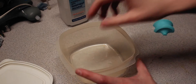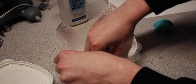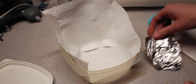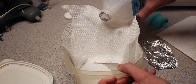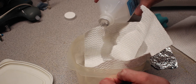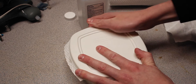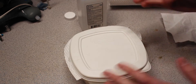So first off, go ahead and open up your container and start laying in the paper towels. The key thing here is to have paper towels covering most of the walls, but I do like to keep one side open so I can look through and see my print. You're also going to need tinfoil or some type of separator to set your print on inside the vapor bath. Now go ahead and pour in your isopropyl alcohol — once you start pouring, work pretty quickly because you don't want the liquid to evaporate before you've closed the lid and put your print in. Now that we've got it all wet, go ahead and set in your tinfoil and set your print inside. Once that's done, put on the lid, making sure not to jostle it too much because we don't want the print bumping into the walls and getting any actual liquid on it. We just want the vapors to be in the air surrounding it.